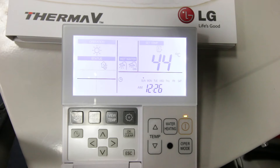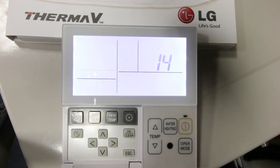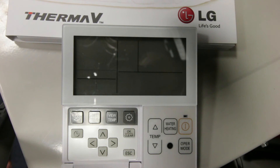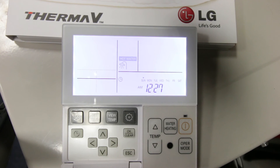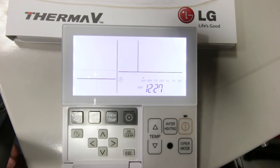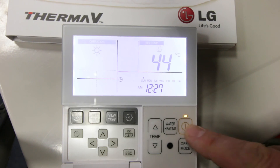As for any breakdowns or faults — in the unlikely event of a breakdown, a fault code will appear on the LG controller display. An example of this would be CH14. This fault needs to be reported to your installer. However, in an emergency you can turn the outdoor unit isolator off, wait 10 seconds for the unit to reset, and if the fault reappears then an engineer will be required to fix it. This is normally something simple like a blocked filter which can easily be cleaned. The most common one is trapped air when a unit has first been installed. You should always contact your installer if you have any concerns with your heat pump system.